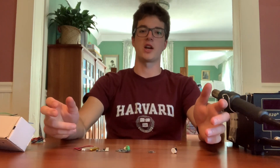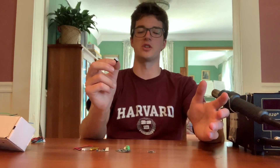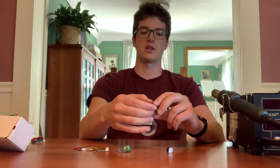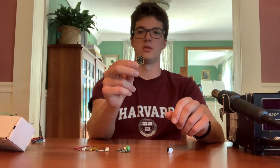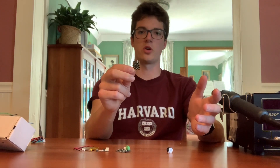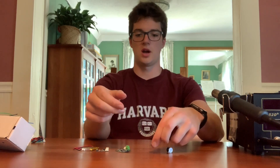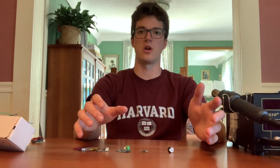The parts we're going to need for this project are actually exceedingly simple. The way we're going to get output from it is through this little buzzer. I technically could incorporate a screen but honestly this is going to be way easier to just let us know that lightning has struck and how far away it has struck. The microcontroller for the project is going to be a DF Robot Beetle. This thing's tiny so it'll work great in the enclosure. It's got full serial output and it's a pretty capable microcontroller — it's based on the 32U4, which is the same as an Arduino Leonardo, so it should be pretty easy to program.